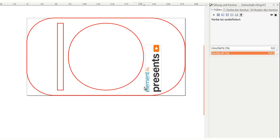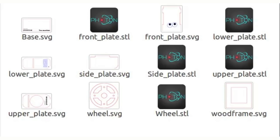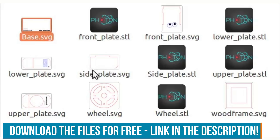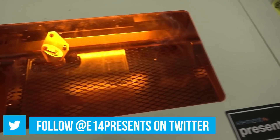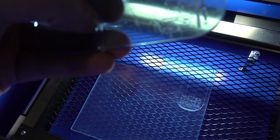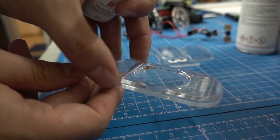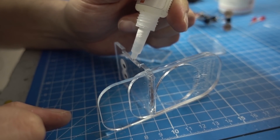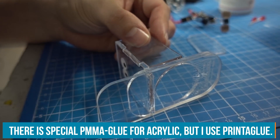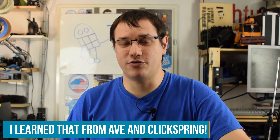I've drawn up the design in Fusion 360 and exported STL files and SVG files — the SVG files are for the laser cutter and the STL files are for your convenience. You can download them freely at the link in the description, whether you want to laser cut, CNC, or 3D print them. I laser cut all parts out of 4mm acrylic, though you could also use wood, any other material, or 3D print them. Keep in mind that you have to firmly isolate the heatsinks from the stands — I used Kapton tape in my first version but later upgraded to a small wooden spacer. The parts that get hot are glued with two-part epoxy, since cyanoacrylate breaks when heated up — a trick machinists use to make superglue arbors they can break apart with gentle heat.